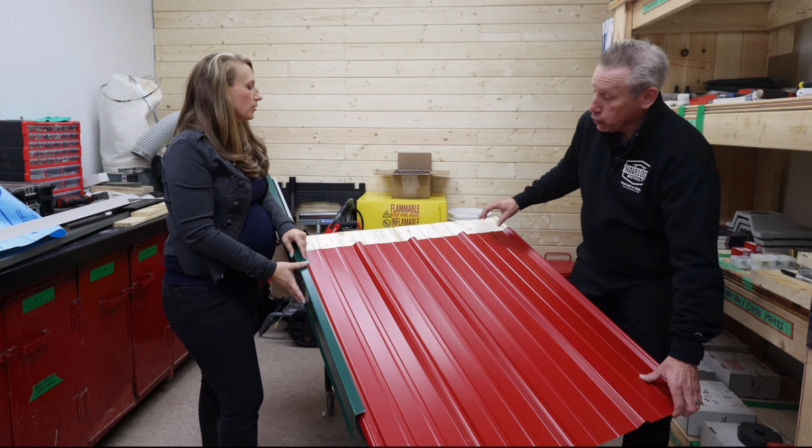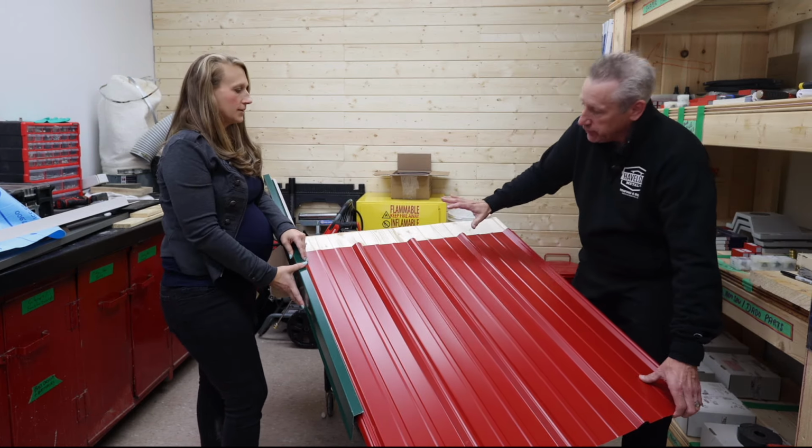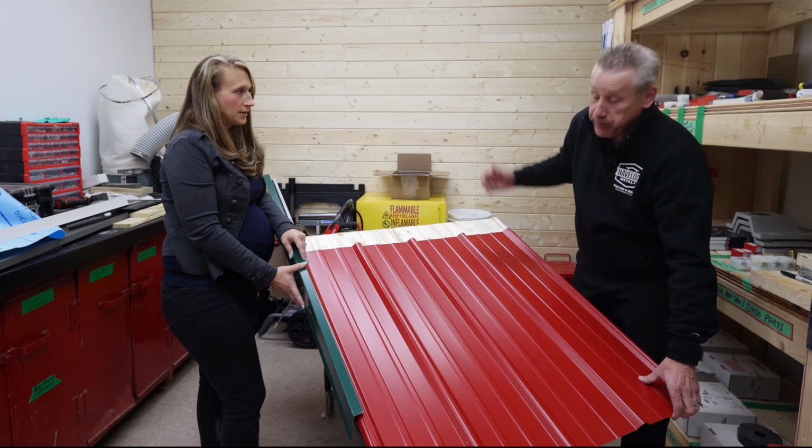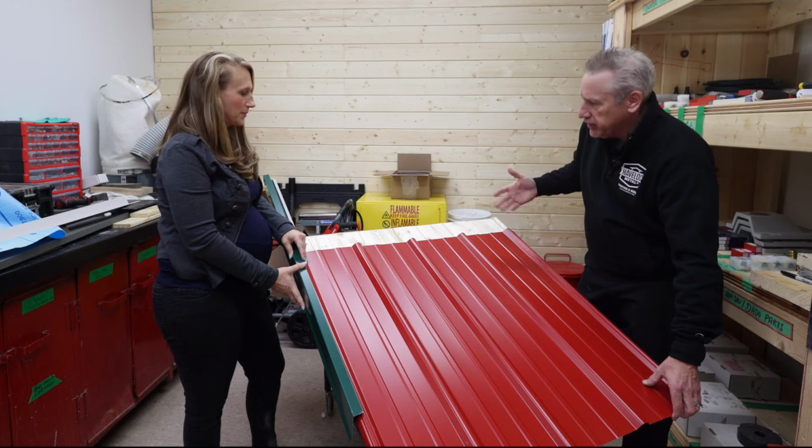And the closure I give you is to seal the edge so water can't drive up underneath it. The whole point is so you can have that available. And you're paying a little less too. It's paid by the foot, so there's less metal to be used. Not that it's a significant difference, but some.